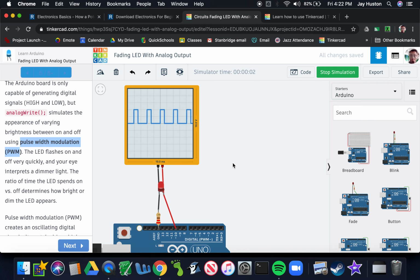Wait, what craziness is this? What is that? That is pulse width modulation. So one of these humps is called a pulse. And they are getting wider and thinner. So the width of the pulse is modulating. It is changing. That's what pulse width modulation means. Now, here's the problem with Arduinos. And you'll notice that when they're thin, this is darker. And when the pulses are wide, when it has big wide teeth, it's brighter. When it has thin, tiny little stick teeth, it gets darker. Now, what this means is, what you're really looking at is the voltage.